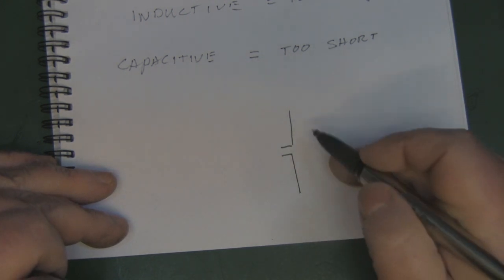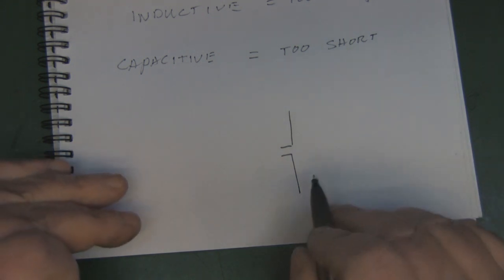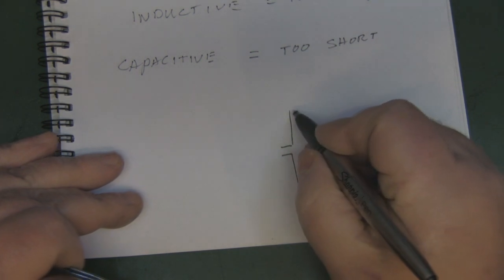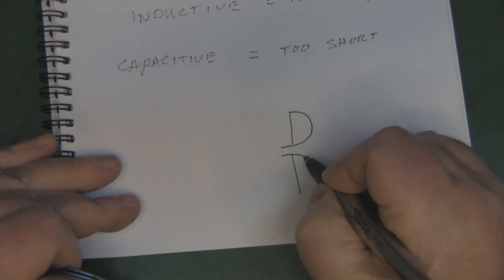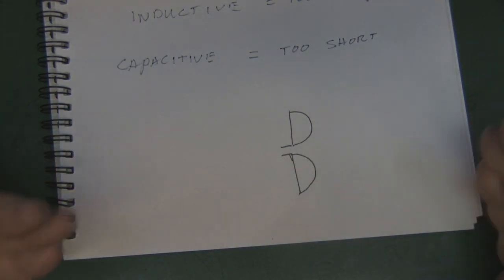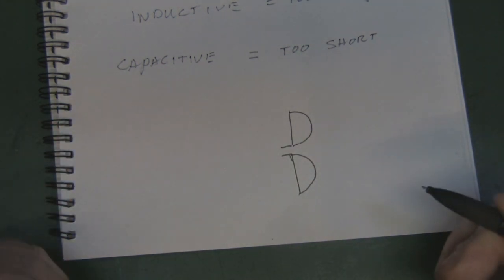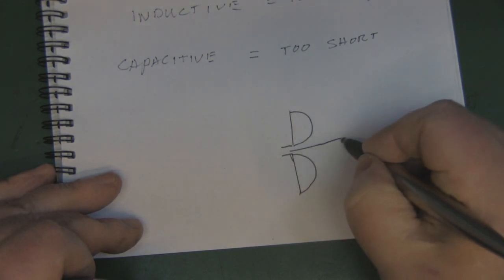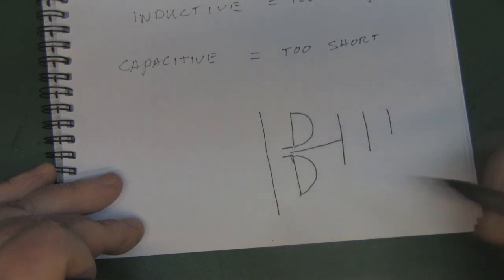Now the reason we don't tend to use this design for Wi-Fi or even FPV is because its radiation pattern isn't very good. It's not very practical radiation pattern, because it gives something like this, excuse my doodling here, but it's not an overall radiation pattern, especially omnidirectional. Where you do tend to see this a lot is with the Yagi antenna design.